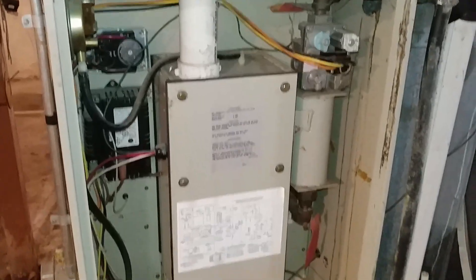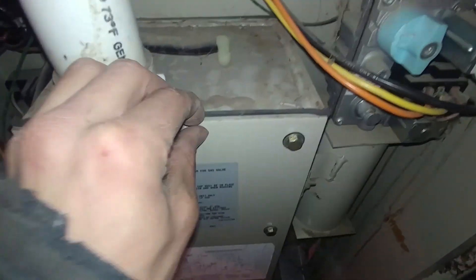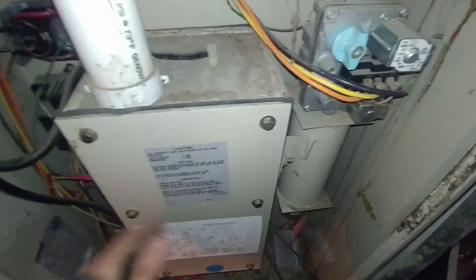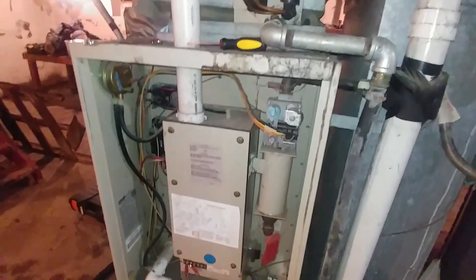It's running just like it was before, but now that we've got this cover bolted back on here, we're good to go. I think maybe why they build these covers so heavy-duty is just so that it can't rattle. If it was made out of any thinner gauge material, that vibration would cause a huge problem. Quarter-inch steel plates welded together, bolted on with a nice thick gasket, and then really thick insulation to absorb the noise. Lennox did a nice job — they're really a neat furnace. They're just old, but very impressive how long they seem to go. Good job Lennox, you made a product that works for a long time.